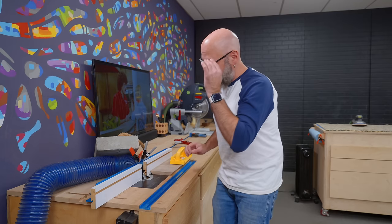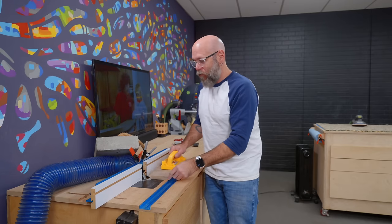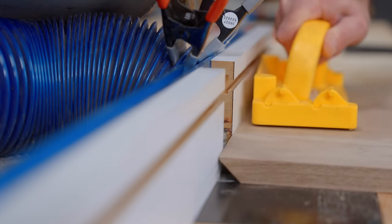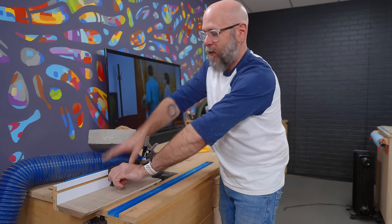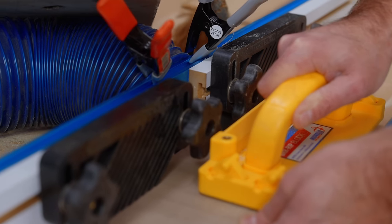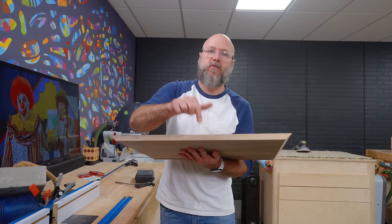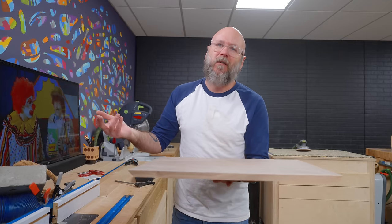I got my bit almost to the perfect height — I'm going to sneak up on it with a couple of cuts because I want this to be absolutely perfect. I'll run this through, bring up the bit just a little more, then run it through again. I'm going to link to Stumpy Nubs' video below — he goes into this in great detail. I'm using some feather boards to make sure my board is pushed down. Now we're going to do a little decorative chamfer using the same bit on the front. This is why we use solid walnut for the edge banding — it gives us the option of round-overs or chamfers.